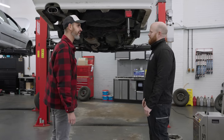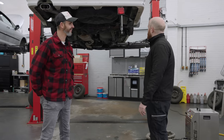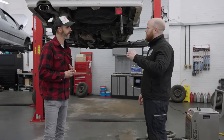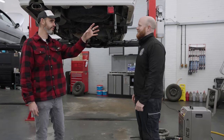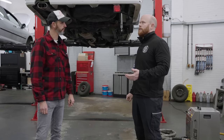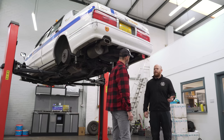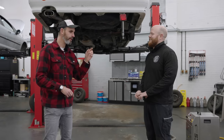The heart of the operation is outside — it's a huge compressor on a trailer, because this works at massively high pressure. The key thing is not just the pressure but the sheer volume of air. A paint shop compressor might run at 7–8 bar with 20 cubic feet per minute, but this compressor runs at 10 bar and 200 cubic feet per minute. So it's moving a lot of air.